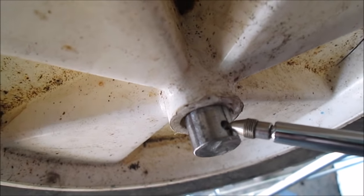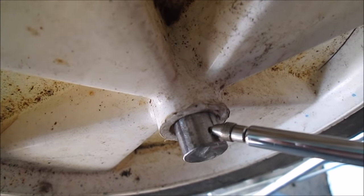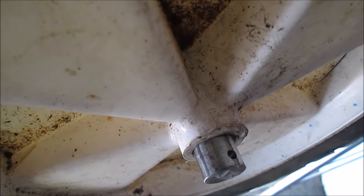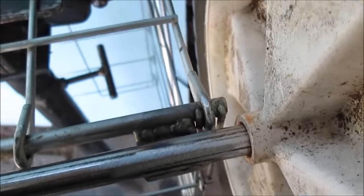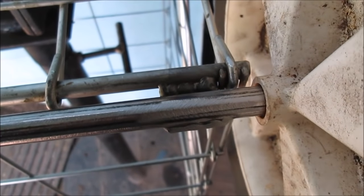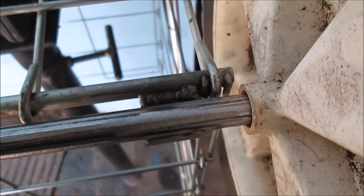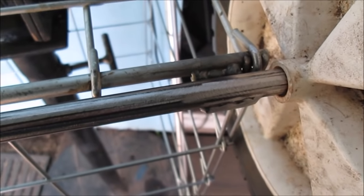I used my homemade V block in the drill press and I just held it. I made a punch mark and made sure it looked like it was going in straight. It wasn't that big of a deal if it was off, as long as the cotter pin goes. So we left plenty of room for washers because we have to shim it out. We're going to probably put a washer on the inside, then tack weld it on the back so the wheel can only go on so far. You know what I mean? Of course you do. Okay, we're done with this end.